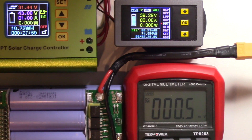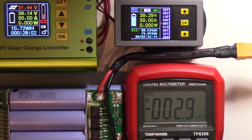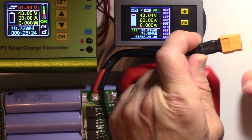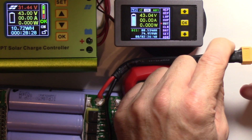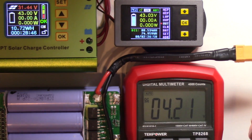I may test it further to see if the other batteries take a bit more charge, but as you can see it says one amp and when I'm putting energy into the charge controller, that one amp doesn't register because it's not being taken. Done charging — zero amps. I'm disconnecting the XT60 and you can see nothing changes. Reconnecting — still nothing. Back on the battery we've got 4.20 to 4.21 volts. The fact that it's bouncing back down to zero tells me it's not taking a charge. Cutoff point: 4.20 volts.